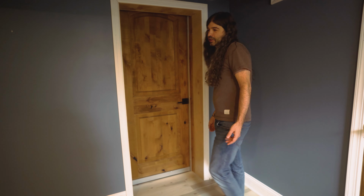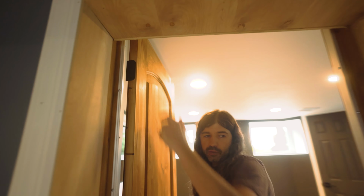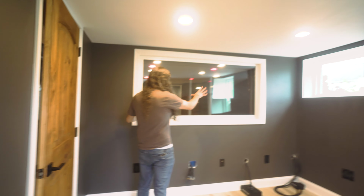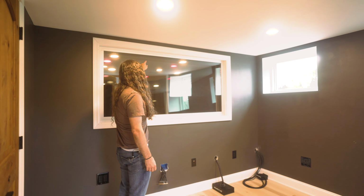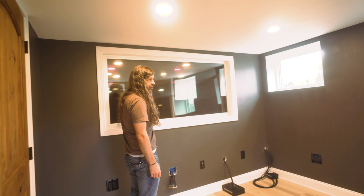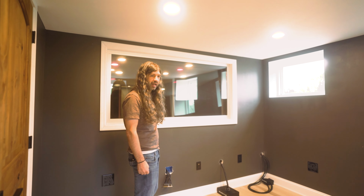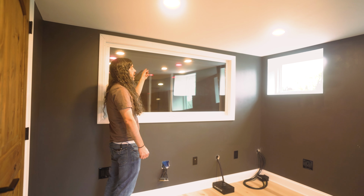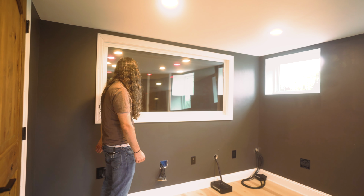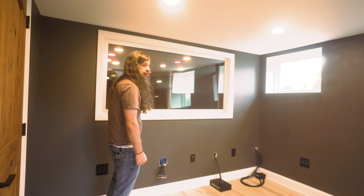Okay, so getting back to the important stuff, here's the studio control room. Again, just like those other 2 rooms, got the door seal in here. We've got our acoustic window between the 2 rooms. I think one of the panes of glass is 3/4, and the other one is effectively 1/2 inch. I think it's actually 2 1/4" panes of glass. The other side is on an angle and this side is straight, and there's an air gap in between them. So the soundproofing is pretty good.